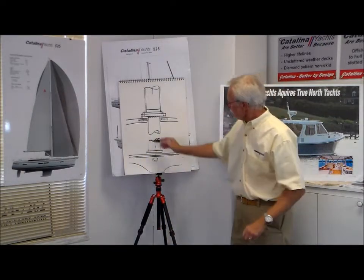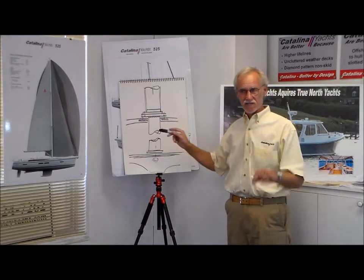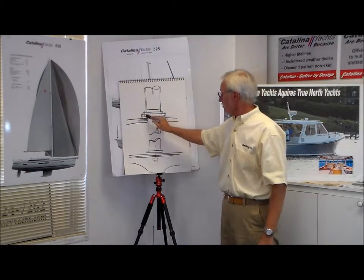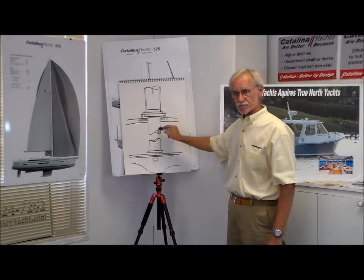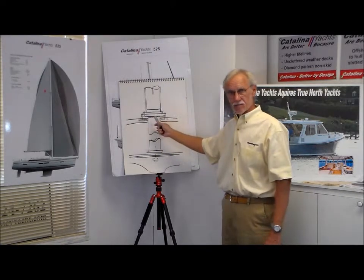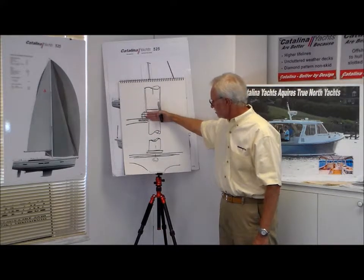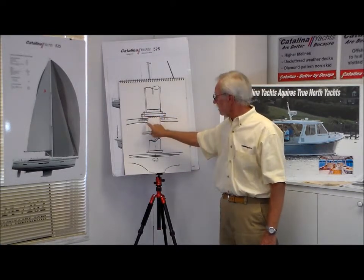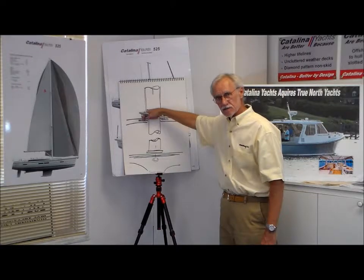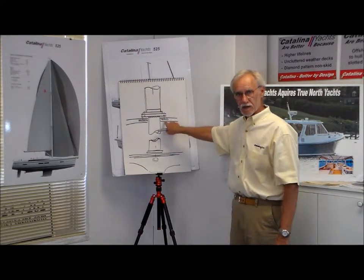So what we've done is all of our compression posts — and this represents compression posts — have a plate welded to the top. You can see them in all our current SOP 5-series boats. That plate is anywhere from a half to three-quarters of an inch thick. We use both aluminum and stainless steel compression posts, and that plate is welded to the top of the compression post. Then the whole plate is put down through the deck after we cut a hole in the deck — in some cases the hole is molded — and we put a little groove in there so we have a place for sealant to go. When this plate on top of the compression post goes down through, it captures some sealant. To make sure we don't have any leaks from that, we have a plate that goes all the way around the mast collar that's embedded in the deck, and the fasteners that hold down the compression post plate are tapped into this aluminum structure around the perimeter. Absolutely leak proof.